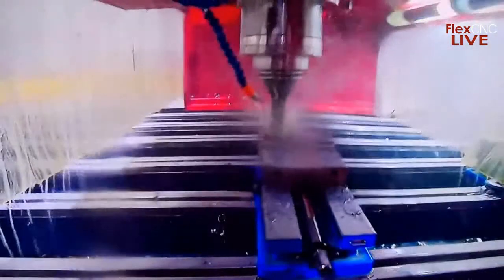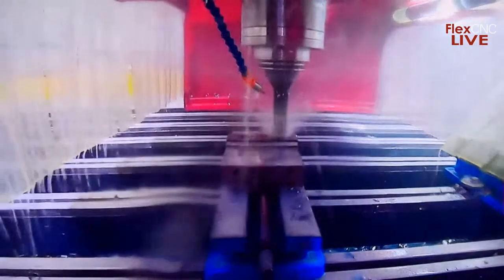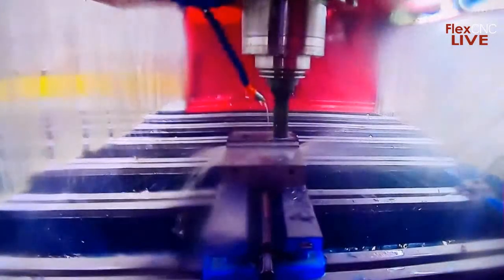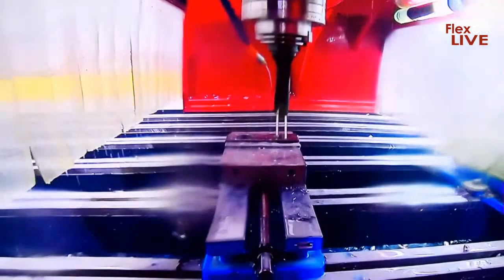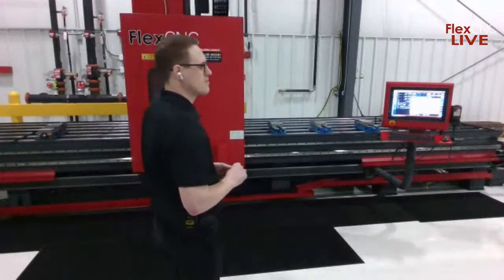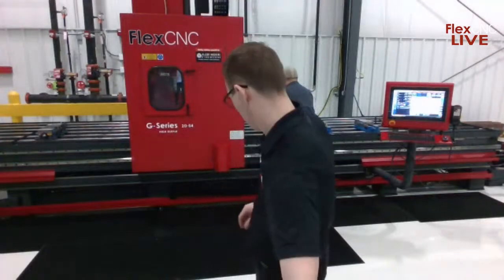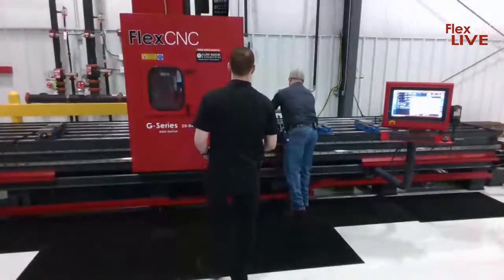Pitch noise. And this kind of goes back to the different grades that they have. The grade that is in the drill right now would be a lot quieter if we were running on, let's say, a 4140, 4150 kind of material. As soon as I pull this part out, I'll give it to Logan. The nice thing about these inserts, so it's two different carbide inserts, and it runs at a higher RPM, but a lower feed rate, and that allows the tool to make a nice finish on the part.